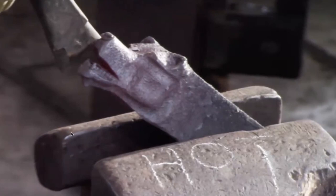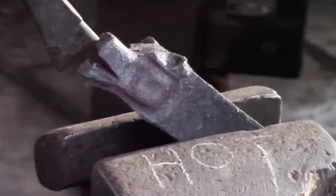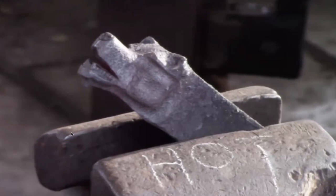And then I don't know what they call this, but the bear does have a bit of a split lip. So put a little mark. And again, I would chase that with your side set. Just make a little groove and then push the material away either side with the side set just to create a little V.